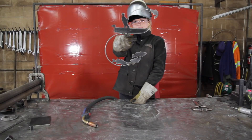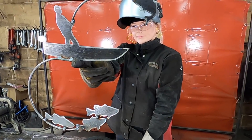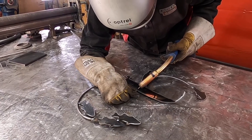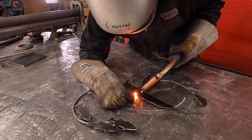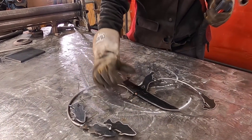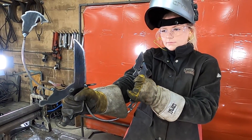Position your fish to the center of the bar to ensure your piece is balanced. Find the center of gravity by balancing the piece on your finger. Weld the pivot point to the center of gravity you have found. If your sculpture isn't balanced the way you like, hand bend the round bar to find the perfect center of gravity.